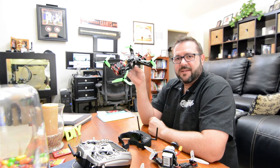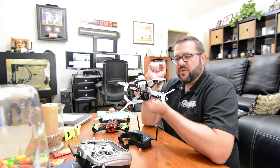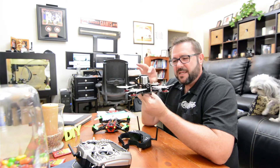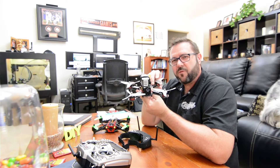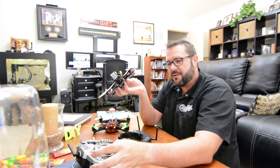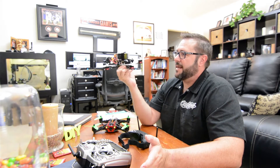We're still using stabilized mode. Carson did really well driving this vehicle around in FPV. With the Space One racer that was built, the first time I fired it up out in the field it was not going to fly that day. My minimum throttle in the flight control board was higher than the minimum throttle the ESCs were programmed for — it hovered and levitated without any input from me. Fortunately I'd set up failsafe and killed the throttle, so the drone only got about 50 feet away. Took it back to the house, reconfigured it — noob mistakes. We figured that out and took it out flying.